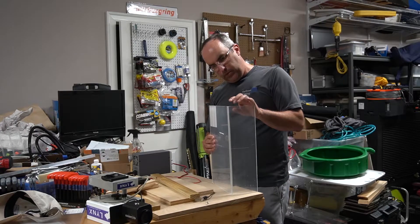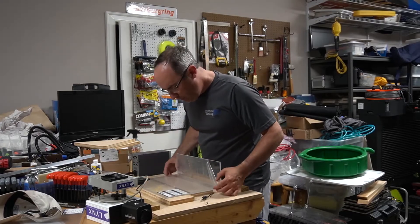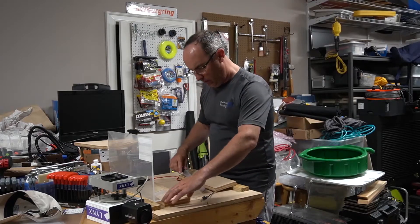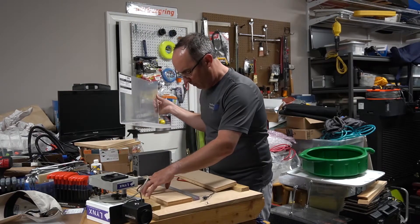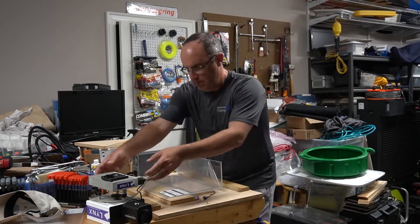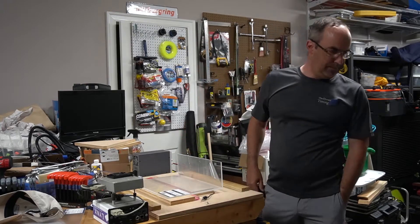There's a little bit of deformation in the corners, and that deformation can be a problem when you're putting a backing plate onto the U-channel for the camera — which protects the back connection points. But it's really a lot better than I was used to with a heat gun, so it's not a big deal. Especially because the acrylic cement I use is medium-bodied and will fill in some gaps pretty naturally.